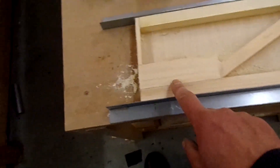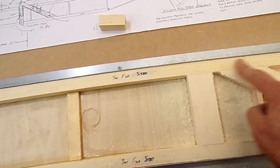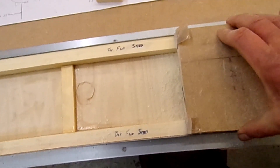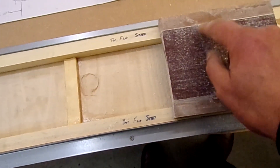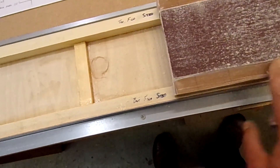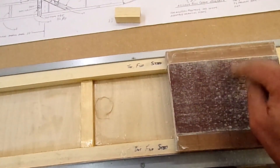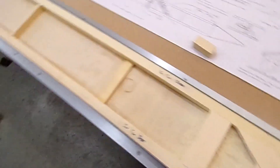A thick layer of glue isn't going to be good, so I need to sand it down — and you can see I've sanded it down. The way I did that: there's no height reference on here, so I made up a block that's the width to run in the runners of the jig for the spar. On the other side I put abrasive material, but if you just put abrasive material it would sand deeper than the capping strip. So I've used tail rotor blade tape — out-of-date tail rotor blade tape — as a running material, putting several layers on to build it up to the same thickness as my sanding material. That way I can just run the guide back and forwards. Nice and easy.